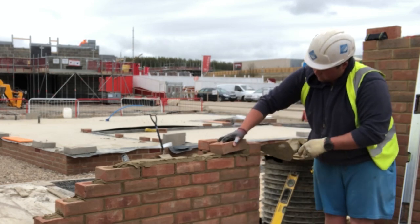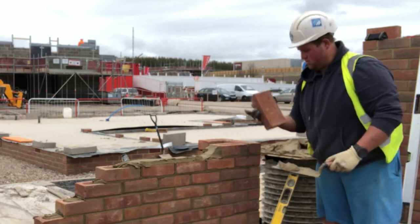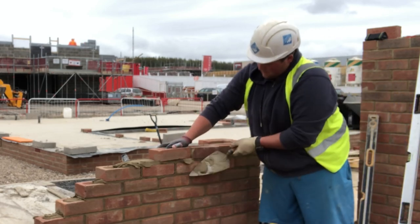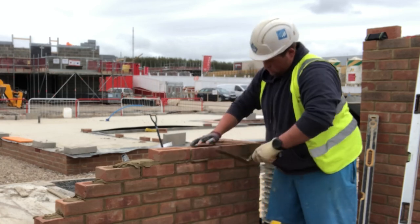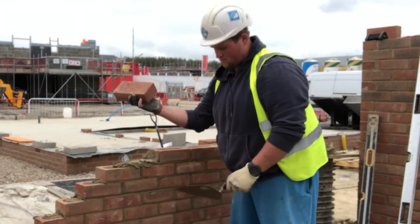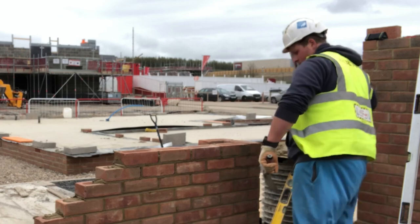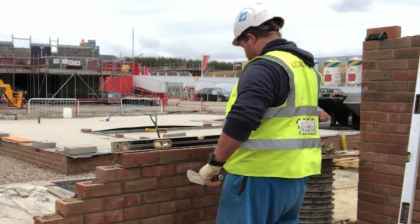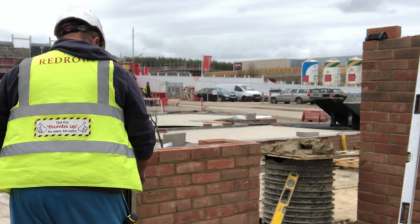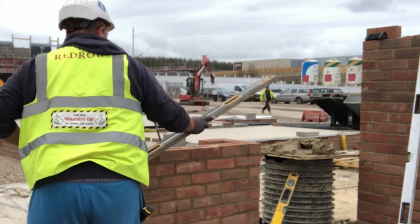Most garages are around 75 bricks a course, so if you leave 9 course on it — 9 courses would be 675 bricks — that's a nice day's work for anyone who has to square up to wall plate. On a good day 675 bricks is a really good day for me. If I managed to get 700 bricks in a day, that's a mega success. But today the plan was two corners running in, and I executed that pretty easily — the day went well really. All the bricks were stacked right next to the gable, easily unloaded with the brick clamps. I also had the mortar tub right behind my spot board, so I didn't have to bucket any mortar today, just all with a shovel. I try and just be really organized when it comes to working on my own, and I tend to do a lot of level work — tailing out 10 bricks along with a level.